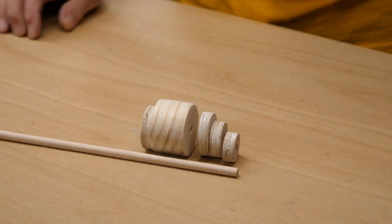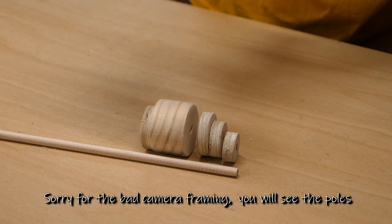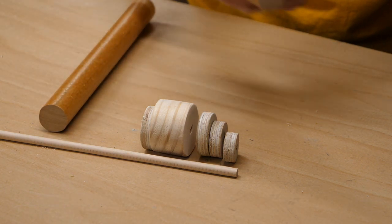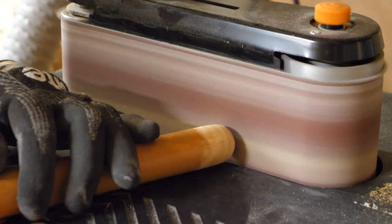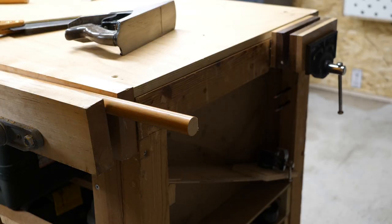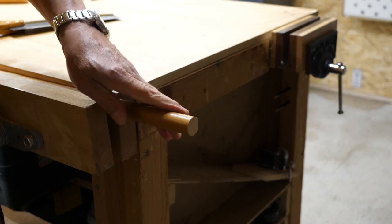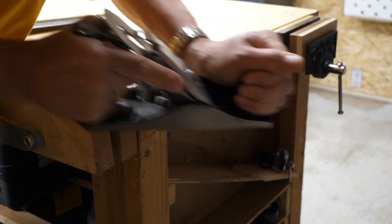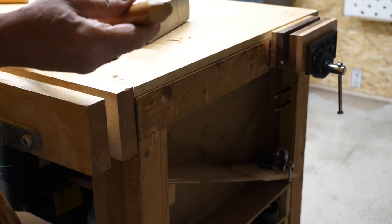To hold all these little pieces onto the dowel and stop them falling off, I need a head and a tail. For the head I'm going to use this piece of curtain pole, shape it round a little bit, cut it off, and there'll be a hole in the back. For the tail I'll use this thinner piece of curtain pole — so never throw away your curtain poles! First I'm going to tackle the head and round the end, then for the tail piece I want not a sharp point but a slightly sharpened end, so I'm going to use a plane and a little bit of sanding.